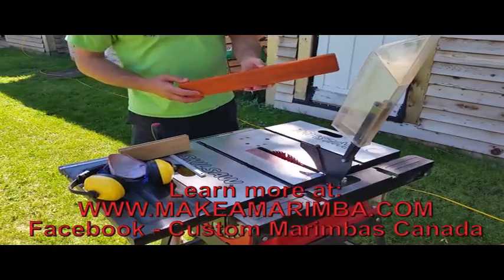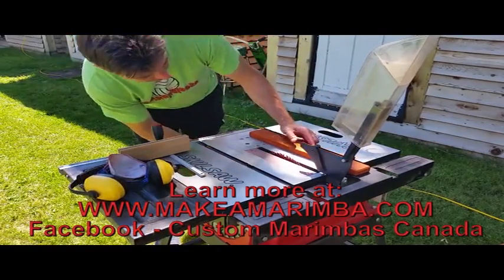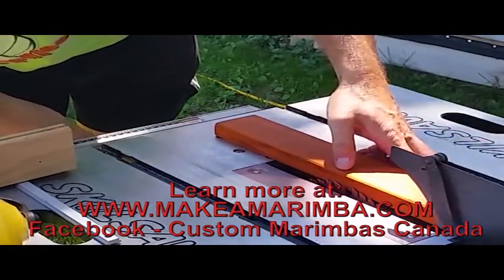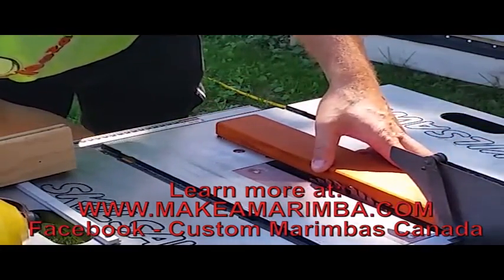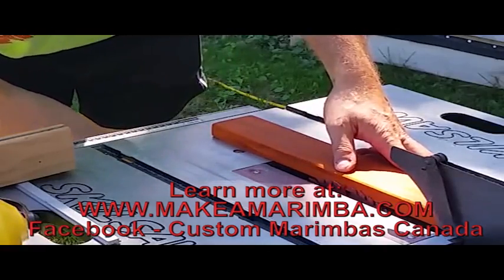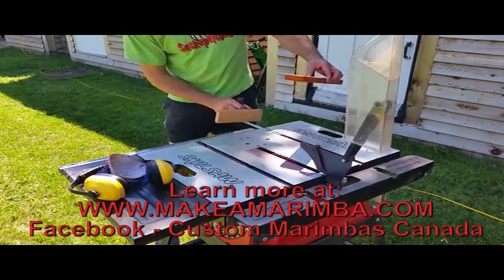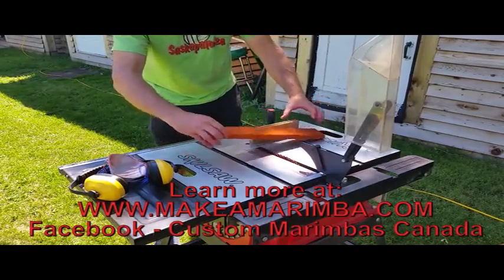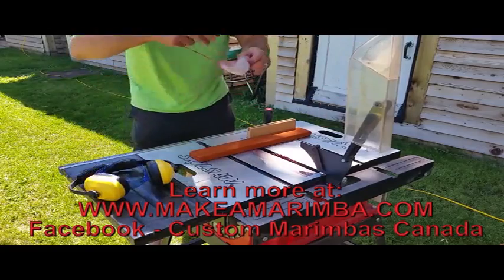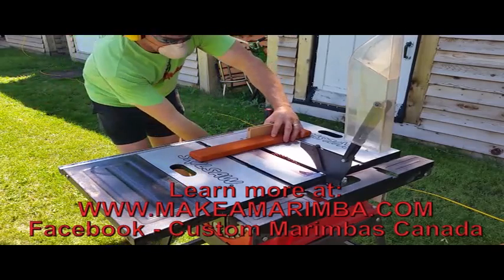To rough out the bar, I'm using my table saw. You could use a dado blade if you wanted — that would be more efficient — but I'm just using the regular blade. The most important thing here is to set the depth of the blade. I'm going to take that arch shape, put it right next to the blade, and set the depth so it goes not quite to the line — I'm going to leave a good eighth of an inch, probably a little bit more, before the line. I've got my slider with a piece of wood on there so it goes right close to the blade — that gives me a little bit more control. And I'm just going to rough that out.